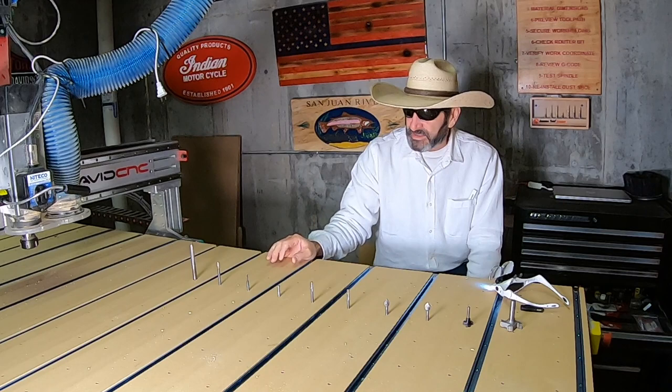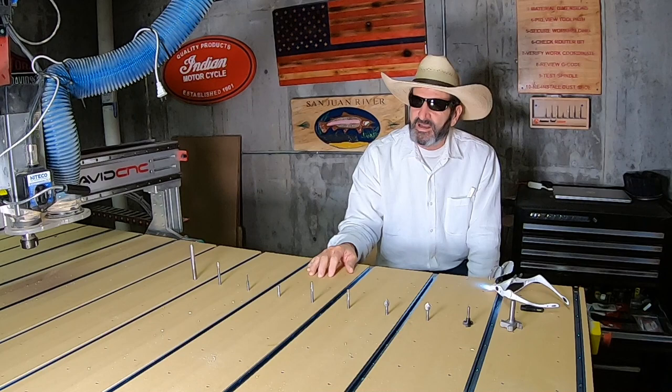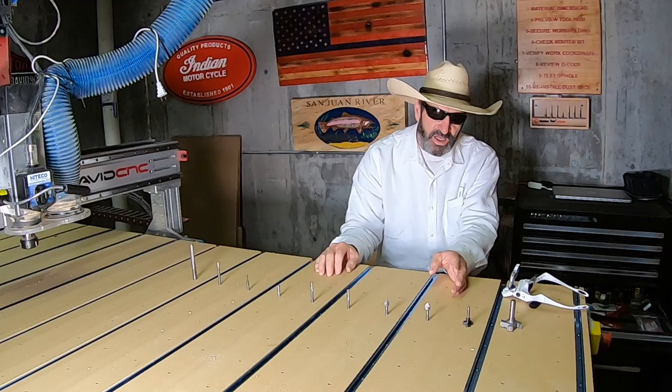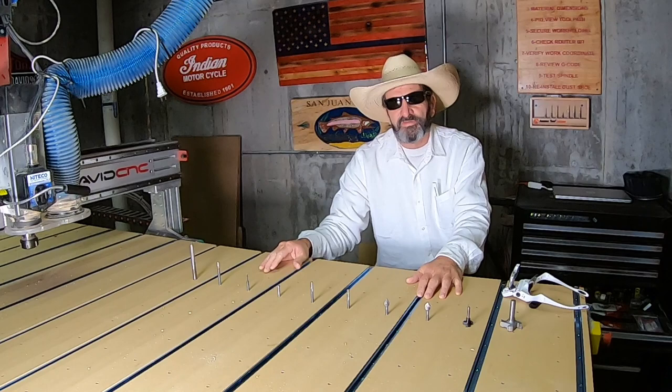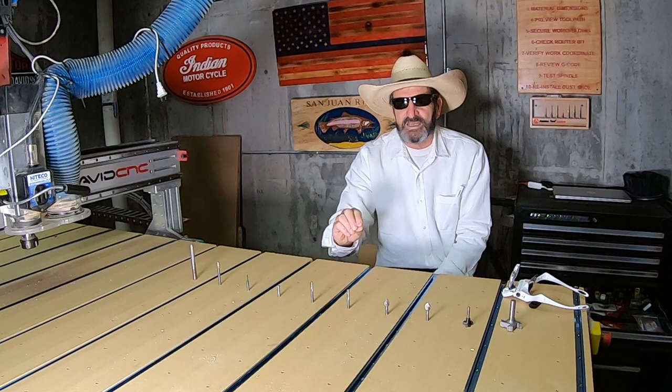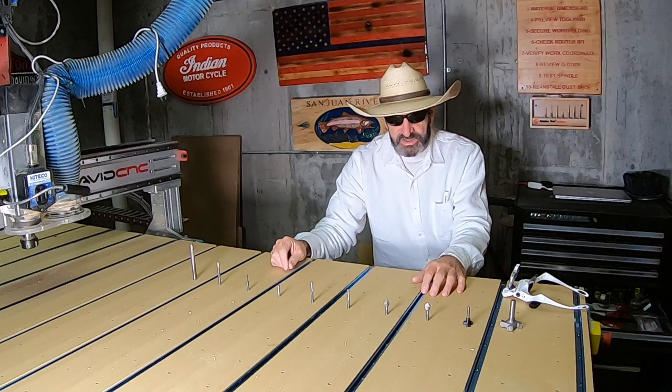In the very beginning I did V-carve signs and epoxy inlays, and I started surfacing my material almost all the time. What I found out, even early on doing the V-carve, was if I surfaced my material the V-carve would come out perfect. But if I didn't surface first and the material had any thickness variation — if one side was thicker than the other — you might not see it, but as soon as you V-carve it'll show up.